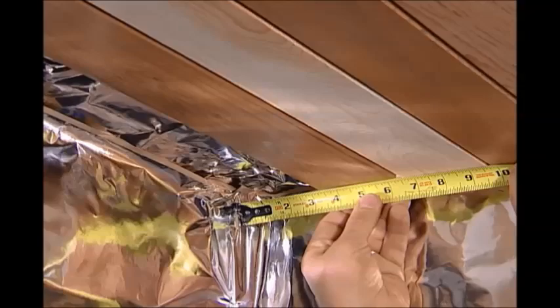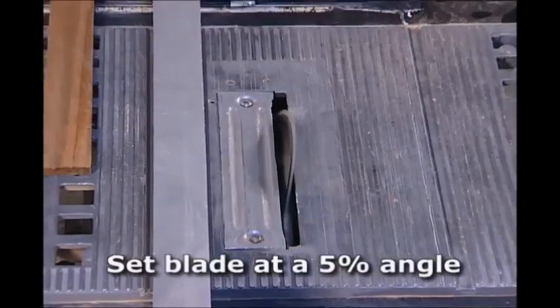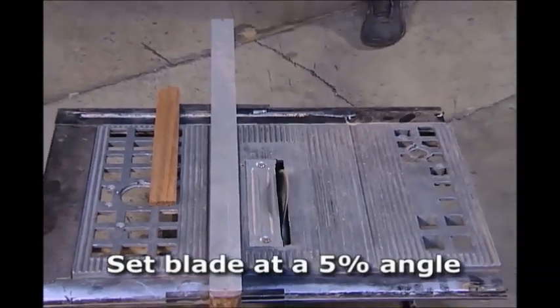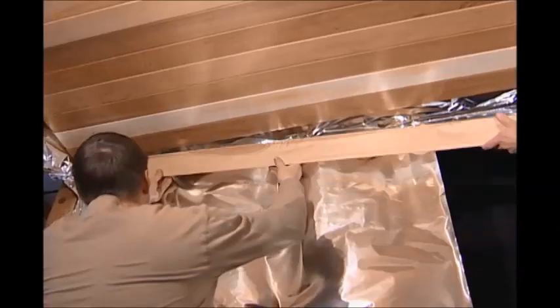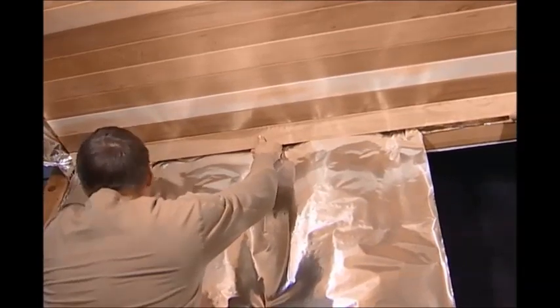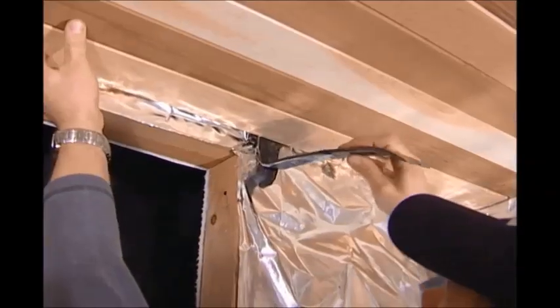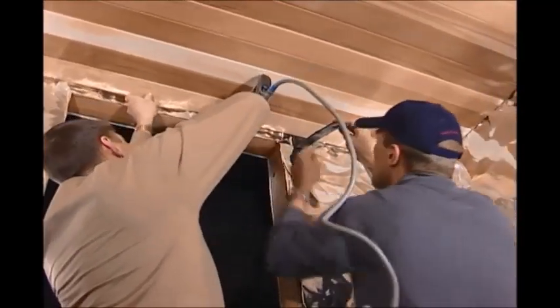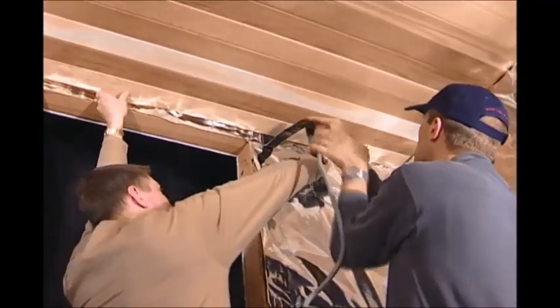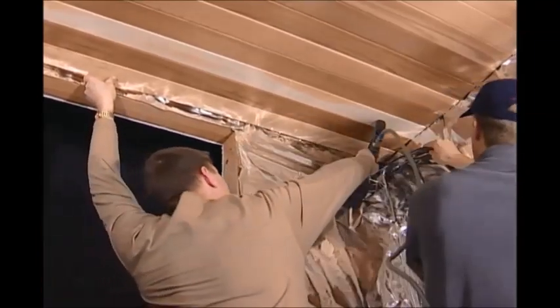The last ceiling board will have to be ripped to fit. Measure the distance between the board and the wall stud at each end, mark the board, and setting the saw at a 5-degree angle, use a table saw to rip the last ceiling board to size. Set the board in place and use a block and hammer to make it lie flat against the joists. Use a pry bar to achieve a tight fit, and face nail at the edges of the board. If you have no solid surface for nailing, pre-mark the ceiling joists so you can face nail to them.